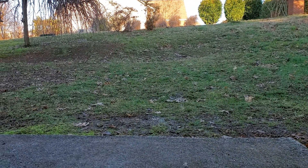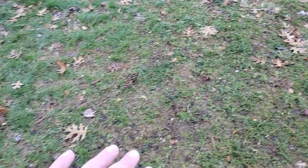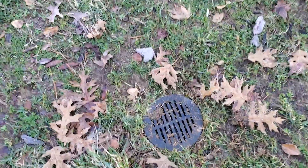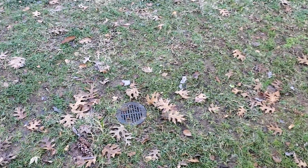This is the ground-level view from the front door. As you can see, there is a slope that comes towards the house from a road. What they did here was they dug a shallow French drain — we are in East Tennessee and we do have a lot of clay. There's a little dip that goes all the way to this NDS valve, so you can see if there's actually water in there, and there is. Water was pooling up in this area, so they created a way for the surface water to make its way into the French drain faster.